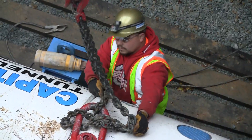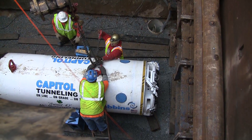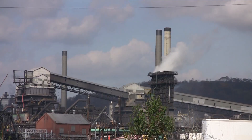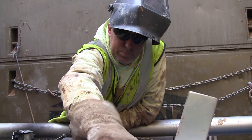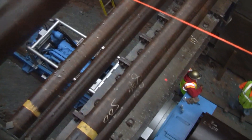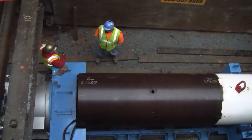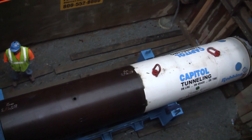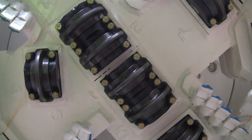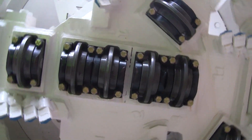A 48-inch diameter SBUM is being readied for a 456 feet, or 139 meters, long road crossing in Clairton, Pennsylvania, USA. The crew is setting up the machine to bore below a large hill. Excavation begins in a launch pit or shaft. This pit measures about 16 feet wide by 40 feet long, or 5 meters wide by 12 meters long. The mixed ground cutter head was specially designed for ground consisting of clay stone.